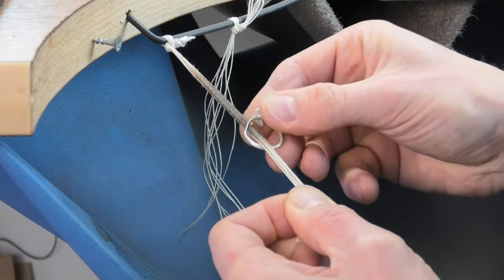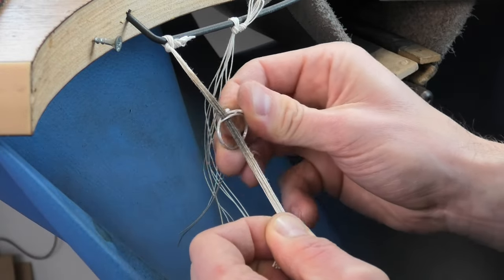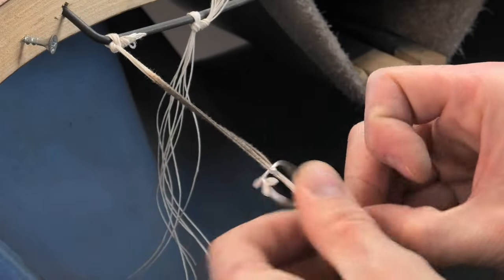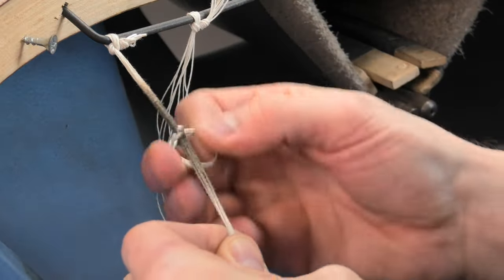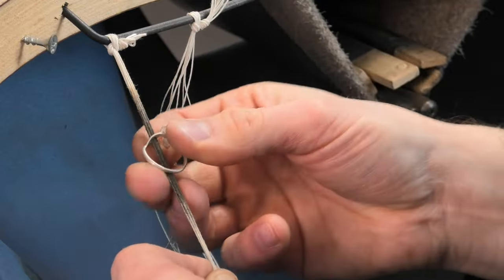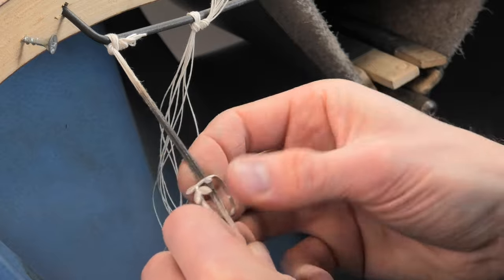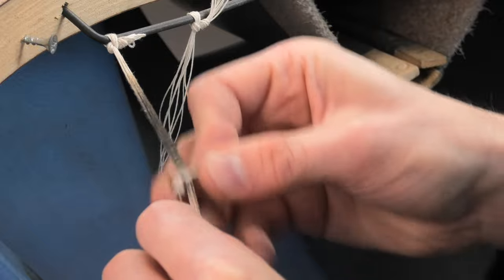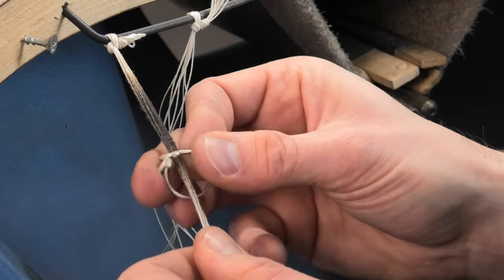Keep the piece moving — don't just go up and down in one spot because that will cut into the metal. Not just left-right; you can rotate it as you're going back and forwards. Add more polish as it comes off; as the polish gets more ingrained into the string it improves its performance. The string goes all waxy and it actually just feels nice. This is only silver so it won't take long, but doing this on platinum you can be here all day.